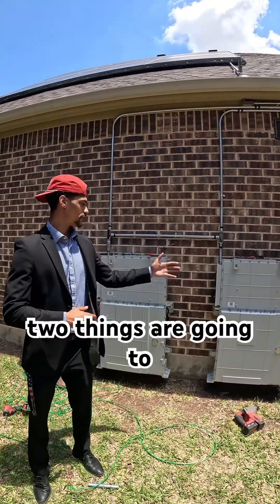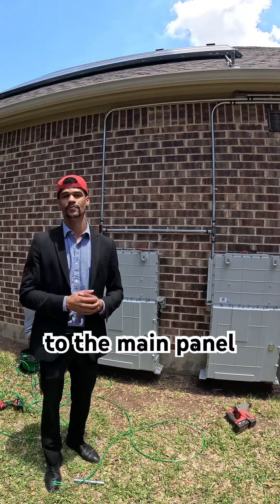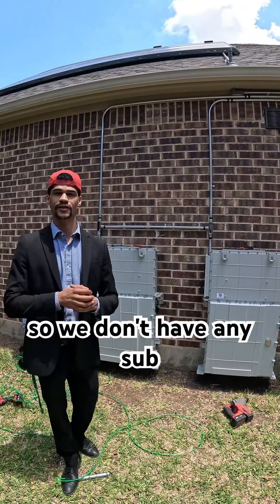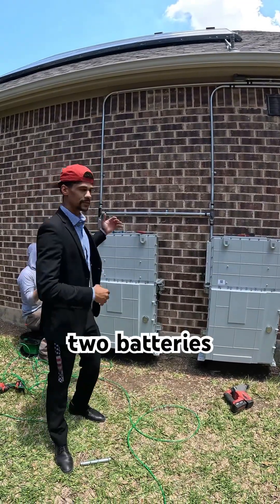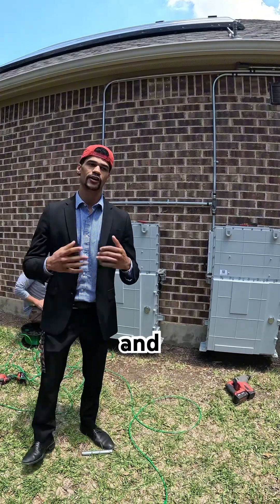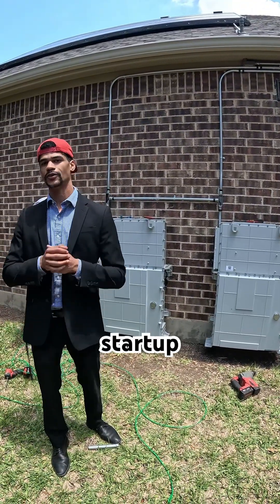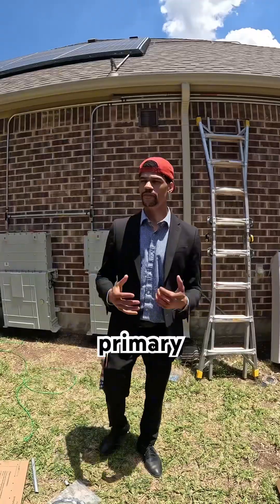What are these going to do for a house? These two units are going to back up the full house. We actually have these plugged in directly to the main panel — no sub-panel or anything like that. Everything is backed up by these two batteries, because each one has 10,000W AC continuous output and 185A lock rotor ramp startup, so there's going to be no trouble starting up loads during an off-grid situation.